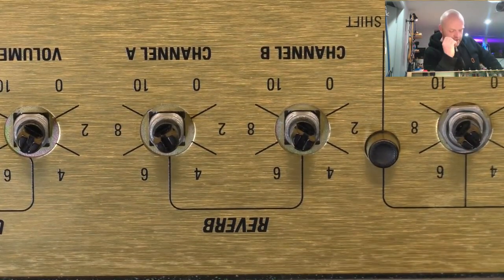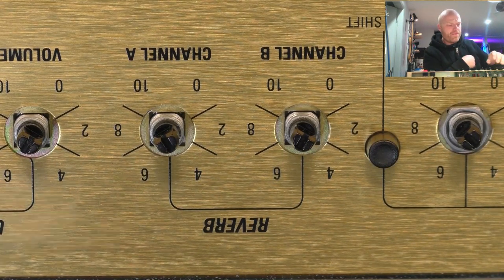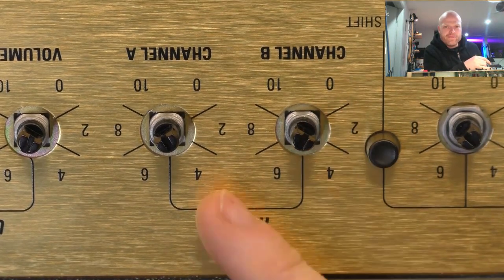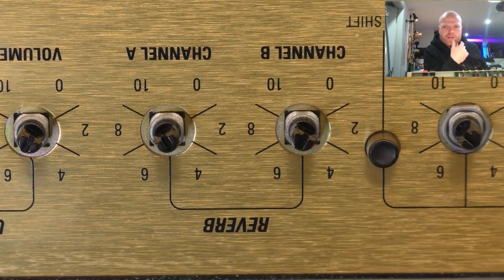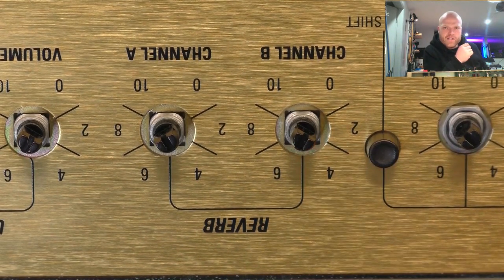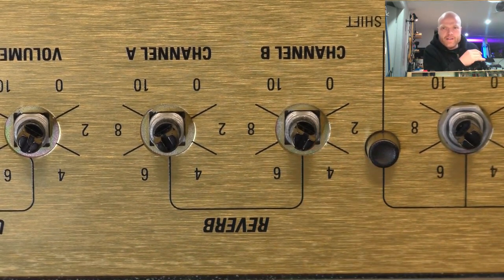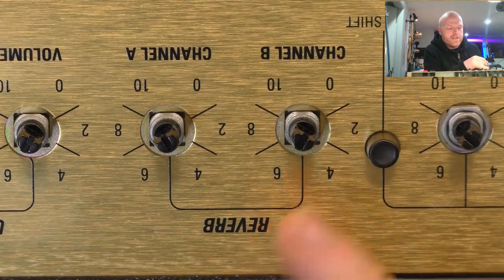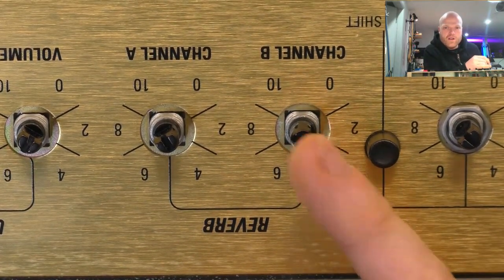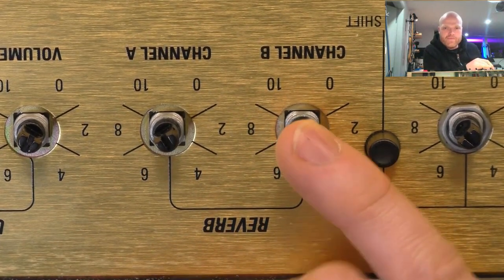So just a quick look at these cheapo PCB mounted pots that Marshall love. They've got like a square shaft. Well, it's not square, but it's got truncated top, bottom, left and right on a round shaft, so it's got flat spots there. Now, they punch a square hole in the chassis, so you don't need a lock nut on the inside, because the pot's travel is limited by the rotational allowance of its clearance in that square hole. But as you can see, that's quite a bit.